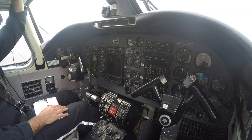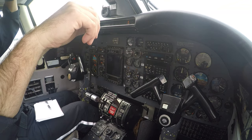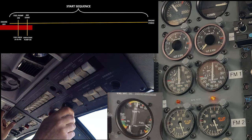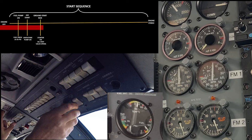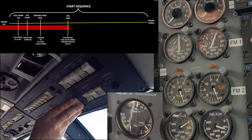We'll start with the number two, or right engine from the pilot's position. We begin by rotating the control switch to the fuel pump on position, then check the gauge to ensure that fuel pressure rises to at least 15 psi. We continue to rotate through air start — this turns on the unfeathering pump. Finally, we press in on the switch so that we can rotate to the ground run start position. This applies power to the starter motor and begins to spool up the compressor. When this occurs we begin to see the RPM gauge come alive. At approximately 10% RPM we have enough airflow through the engine to turn on the igniters and open the fuel valve.